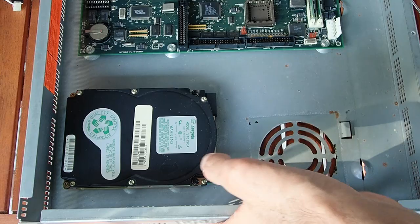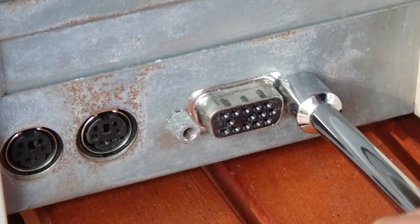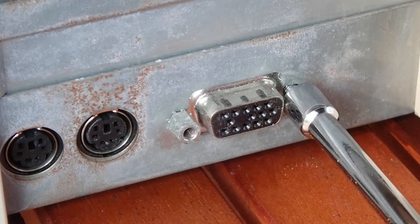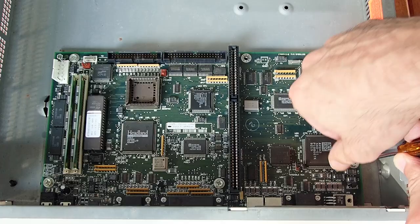The hard drive is held by four screws through the bottom of the case. To be able to take the mainboard out of the case, the standoffs on the I/O ports must be removed first. The mainboard is held in the case with another six screws — the whole thing is held in by twelve screws altogether. Unbelievable. I guess less would be sufficient — I'd prefer some screws in the fan and on the speaker instead.